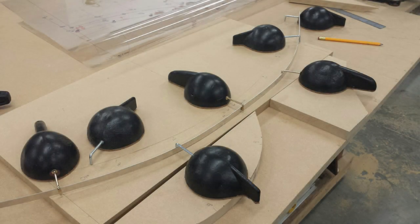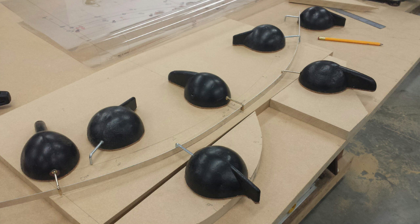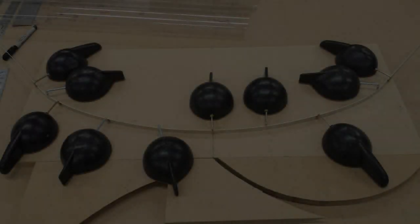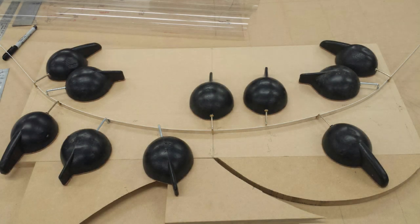This is a discussion that Martin and I had the other day, because when I was researching it, there are two schools of thought: on the air side for aircraft lofting they called them ducks, but for the naval side for ship building they called them fish — or whales, or elephants. Lofting weights is what they actually are. So they would draw out the main profiles, then go out to the tool shop, and the modelers would build full-size plaster models. Any small errors that would be in the drafting would get cleaned out when they wiped the plaster into them, so it all got smoothed out.